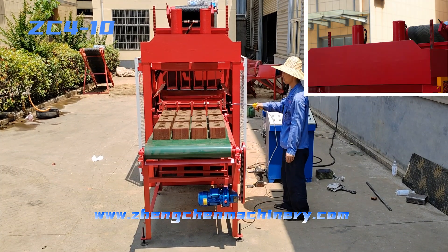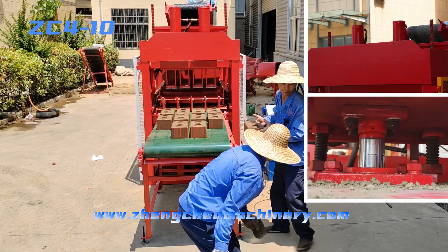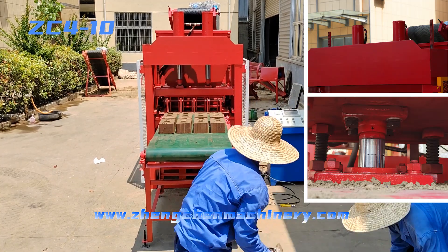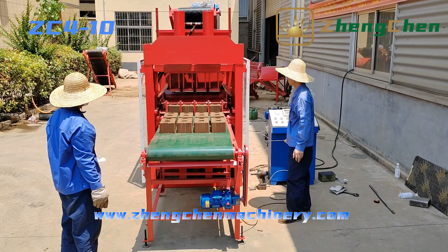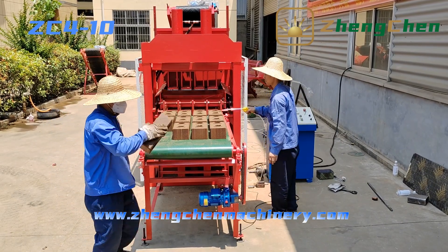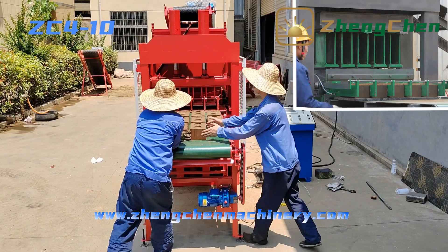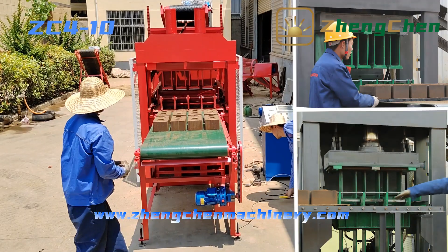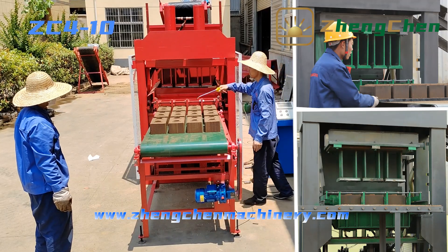The hydraulic system is equipped with two 125mm top hydraulic cylinders and one 100mm bottom hydraulic cylinder. The three hydraulic cylinders work together achieving 40 tons of pressure. Generally, the bricks are clamped to the brick conveyor belt, requiring two persons to carry bricks to a trolley and another person to transport them to the curing area. There are two optimization schemes: first, put pallets on the brick conveyor belt to carry four pieces together; second, use a pulley-type conveyor substituting the belt conveyor so bricks can be clamped directly onto pallets.